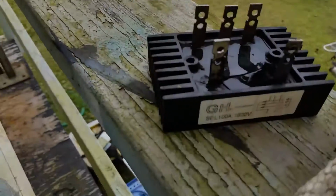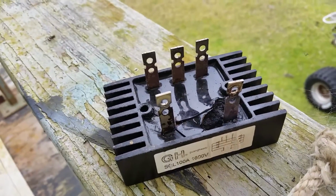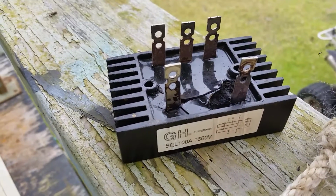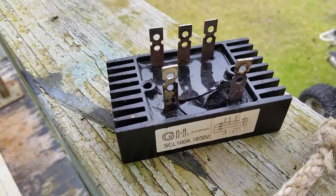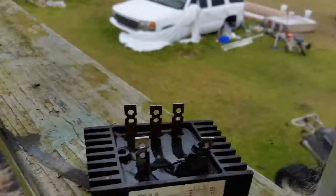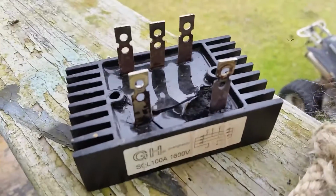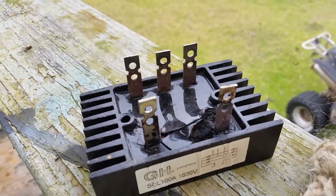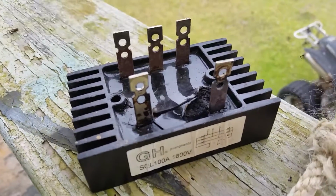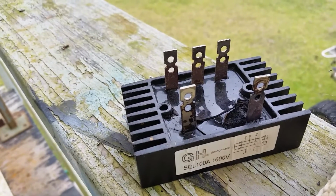His wind turbine's good. So now the next one I have to work on is my father's. My father's wind turbine is technically wild three-phase AC, but his bridge rectifier is mounted up in the wind turbine, and it doesn't look like this. It looks a little different so it can fit into the PMA casing, the AC Delco case.